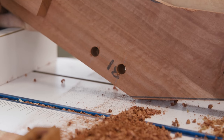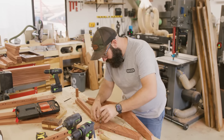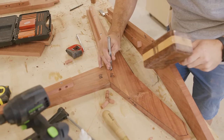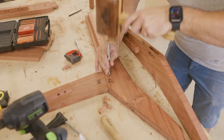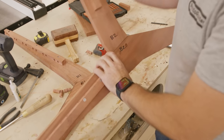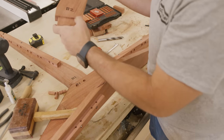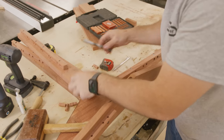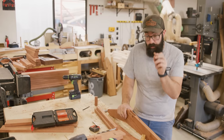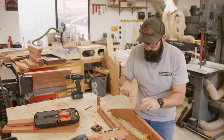I've got my through hole and the tenon already in place. I'm going to take my bit, put it in the middle, and use my mallet to set the center of the hole. With the centers marked I'll pop the joint apart. Then I'll take the drill bit back to the drill press and move just slightly up from the mark. When the pin goes through the cheek and into the tenon, because it's offset up a little, it'll pull the joint down and seat the shoulder really tight.